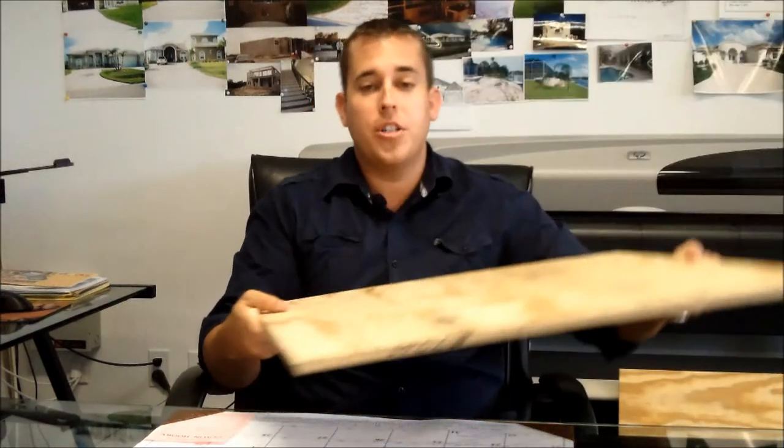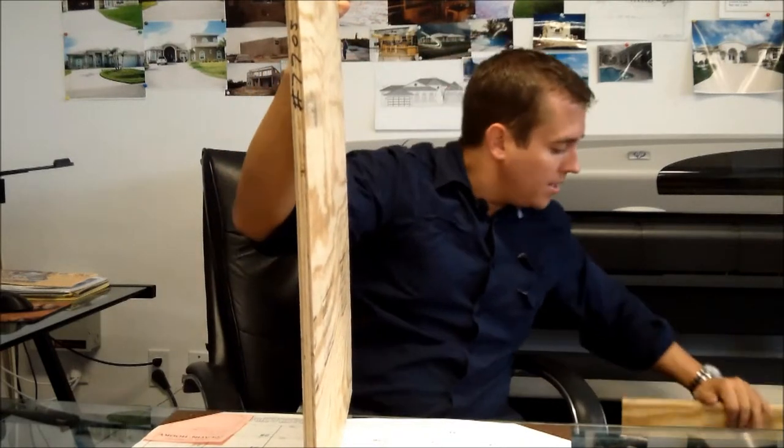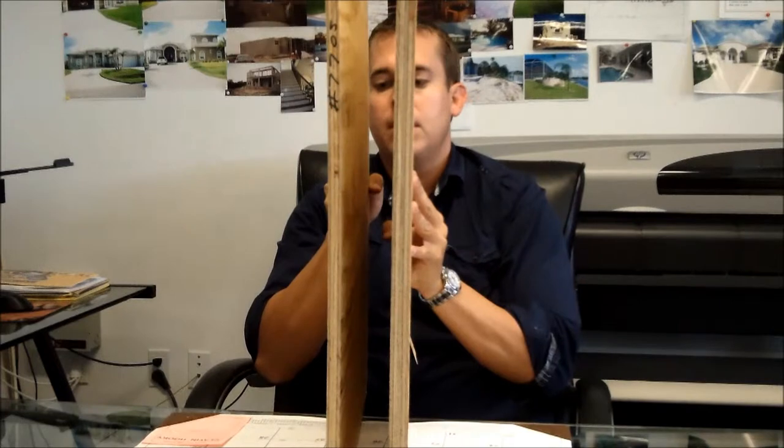But when it comes to tile roofs, the amount of weight on that roof — especially in the event of a hurricane where wind can get underneath and create vibration — screws and nails that hold the roof down can work themselves loose, the tile can fly off, and with the amount of weight on a tile roof, it's of utmost importance to make sure your sheathing is thicker than just the standard half-inch. At Frank Frederick's Custom Homes, we prefer to use five-eighths sheathing on tile roofs. Here is an example of your traditional half-inch sheathing, and this is the five-eighths sheathing we prefer to use — you can clearly see how much thicker it really is. This gives you the best protection from your tile roof coming off in the event of a hurricane.